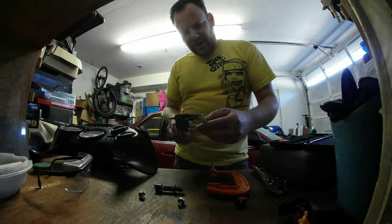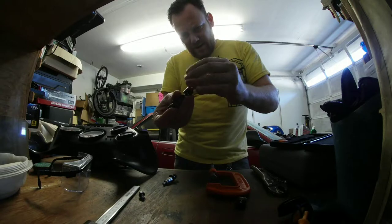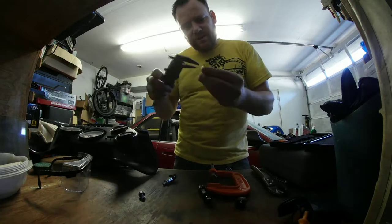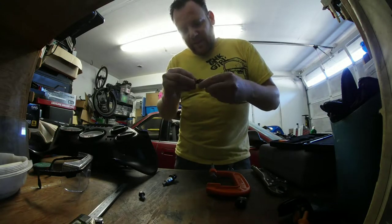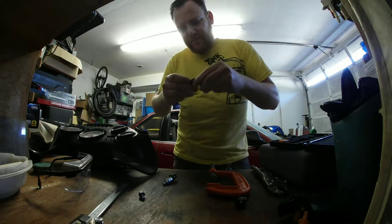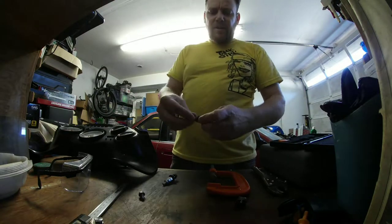to be in there, so I'm basically just going to cut this down in half, and then basically this needs to fit into here, and just above, let's see what 6.5 millimeters looks like here, going to go down, that'll be the 6th thread. Alright, so we just kind of mock this up. This will be down to 1, 2, 3, 4, 5. Okay, so it looks like this bolt right here, I'm just going to leave as is for the extra length, for it to be able to fit in this area and fit down to that with the thread lock.